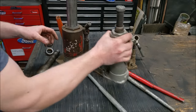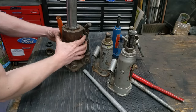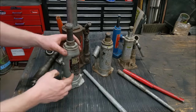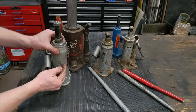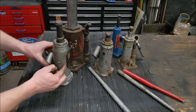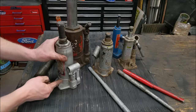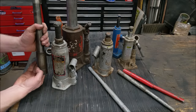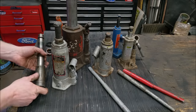That's why there's a little fill plug on all of these — the outside reservoir area can be any size. This one needs a bigger area to hold fluid because the middle piston is so large. If this were clear, as you pump it up the fluid level drops from the outside housing, gets sucked into the pump, and goes up into the hydraulic ram, forcing it up and out.